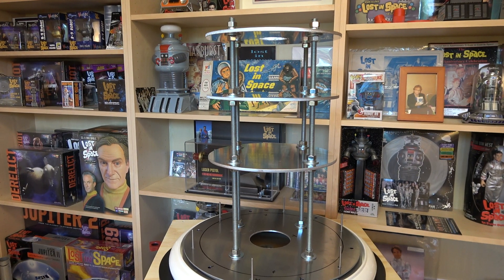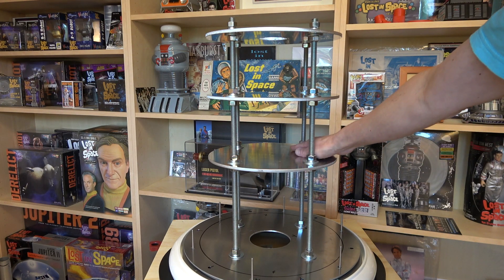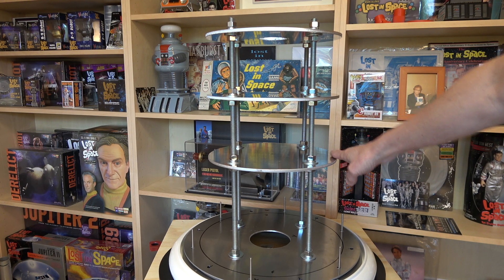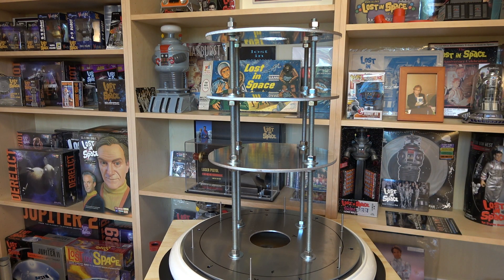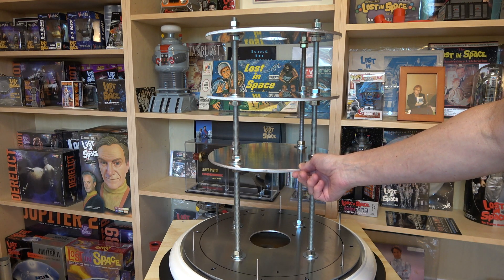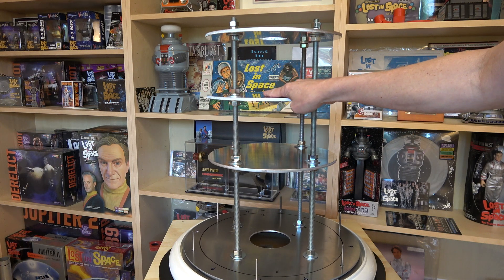The reason I used aluminum on mine is because this center plate is going to have wings that come out and support the arms, which are going to be fully mechanical and motorized. So they're going to be very heavy and need something solid to be on. A thin piece of acrylic or something like that wouldn't work in this case because it would flex too much. In my case, it has to be super rigid.